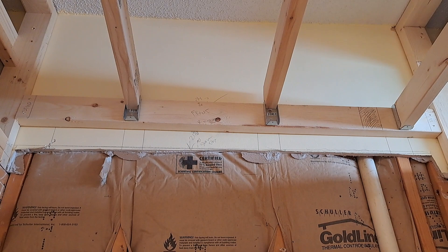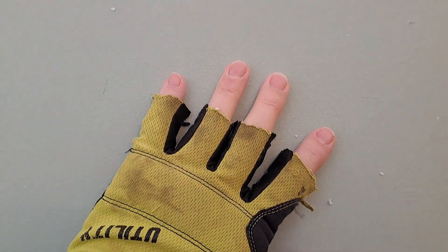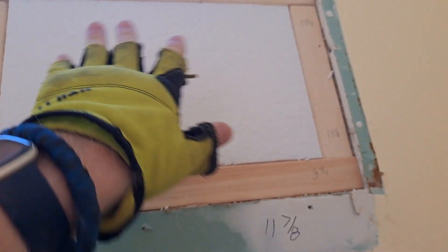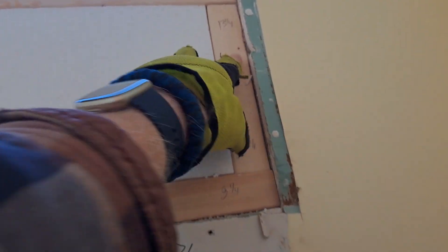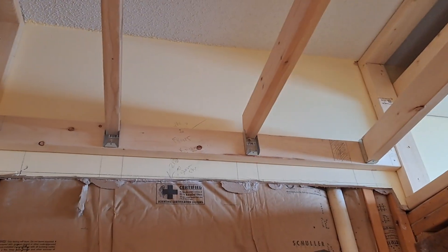Alright, I'm making good progress. I tell you, that insulation looks like a charm — last night I was putting my hand here and it was warm, and then down here it was a little chilly, so it's nice and warm up here now. What I did was just put layer upon layer upon layer — I think there's like four layers on there. I didn't make a template; I just took measurements: 13 and 8, 13 and a quarter, yada yada. I tried to make it a little bit bigger than the opening to kind of squeeze it in and give me a better seal.